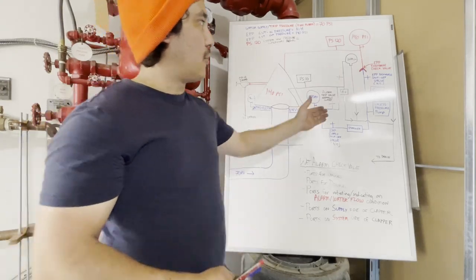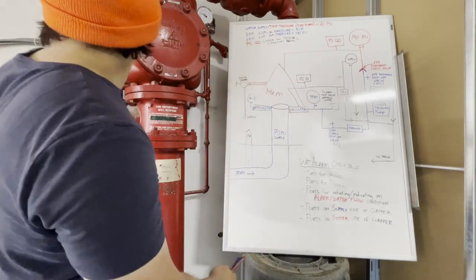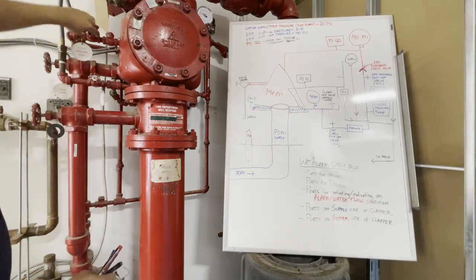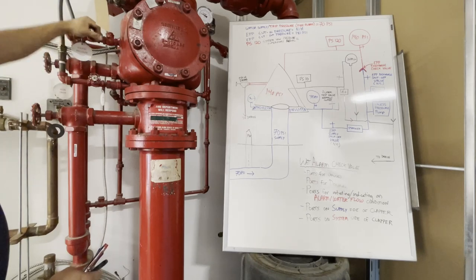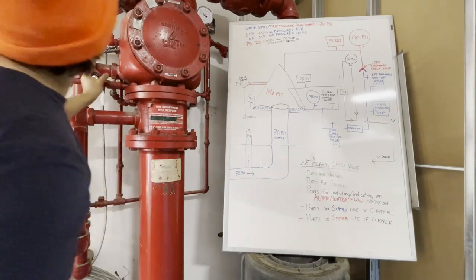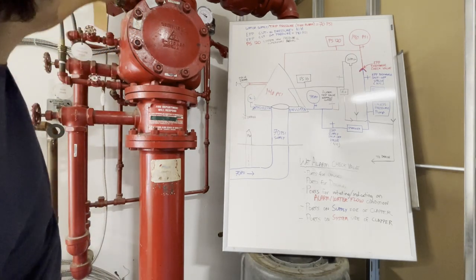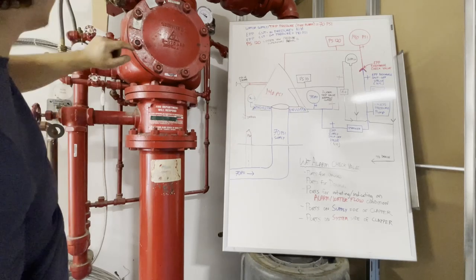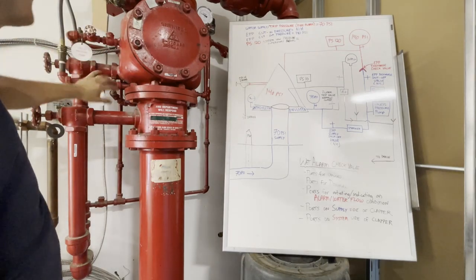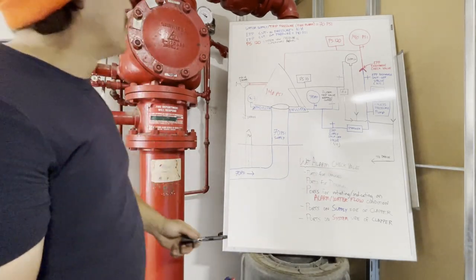For this system, that is how you pump up the system. I would pump it up, get to 140, then turn the light switch off for the pump. I close my excess pressure pump discharge shutoff valve, close my excess pressure pump supply shutoff valve, and that's it — I've pumped up the system. Actually, this is a good example: while these were open, this gauge actually dropped a little bit. I know this check valve fails because when I close it, it actually locks in the pressure. So this check valve does not hold — if I left this for another few hours, it'll only be a matter of time before they get low pressure.